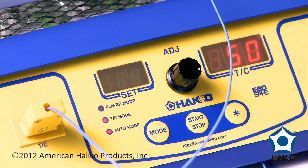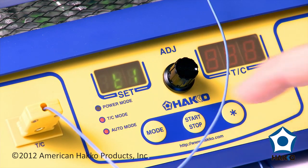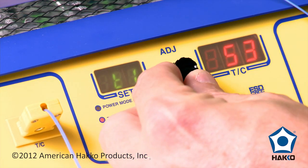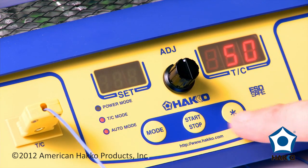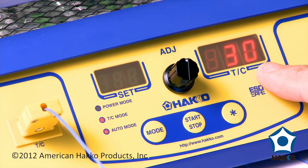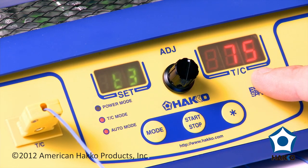In this first step, my target temperature is going to be set for 50°C. I can press the star button — which is just like pressing enter on a keyboard — and move to my next value, using the knob to make adjustments. I'm just going to leave it at 50°C for this demonstration. Using the knob again, changing to T2 which is my time in seconds — I've got 30 seconds. My next one is T3, my next target temp. I'm going up to 75°C at this point.